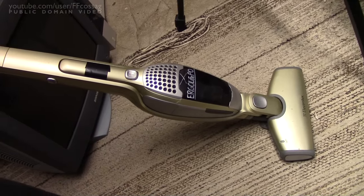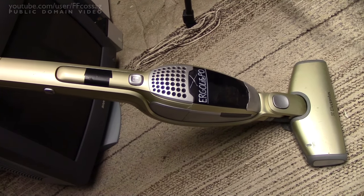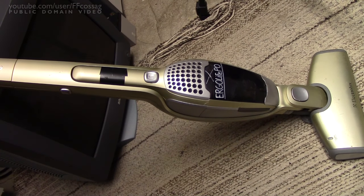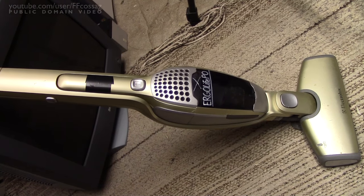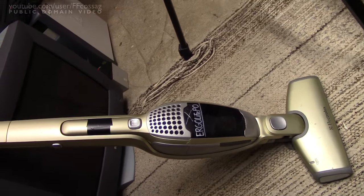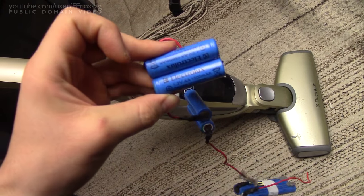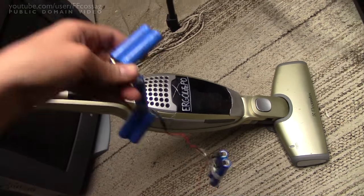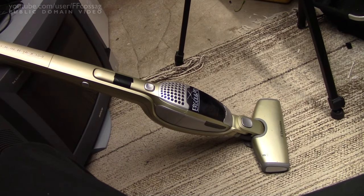So there you go, that's the Ergo LiFePO Hacky Vacuum Cleaner. All that's left is to do a test run to see how long it'll actually run. I'm going to bet that these roughly 1.3 amp hour LiFePO4 cells are going to be a quite considerable improvement over the original nickel metal hydride batteries, since I think they were like 1300 milliamp hours. So that's not too impressive. Yeah, that finally turned into something. Thanks for watching. Cheerio.